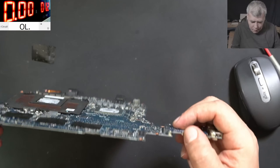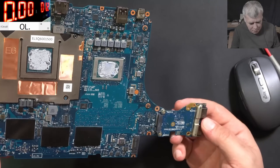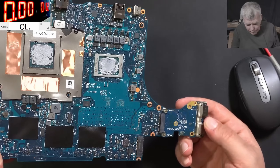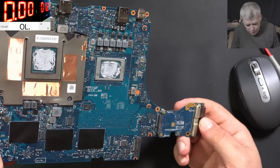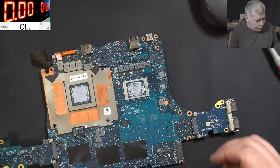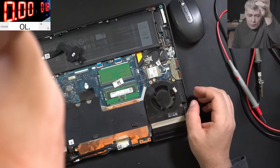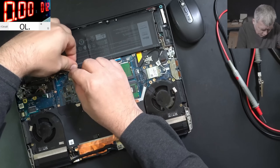Having in mind how expensive this laptop is — the CPU can actually be replaced quite easily. It's smaller than a chipset; you can do it with hot air if you can find the CPU. Let's see if the CPU is still good. If it comes on, let's put back the heatsink. The board is back in place — plugging in the battery.